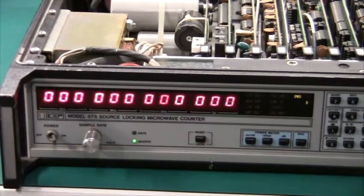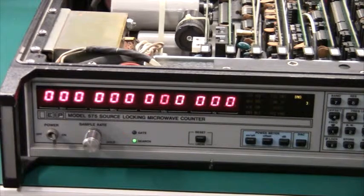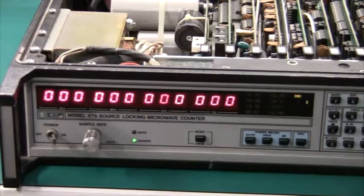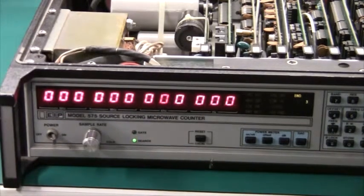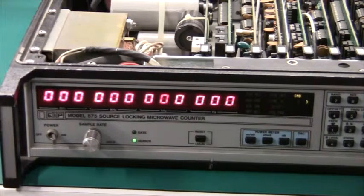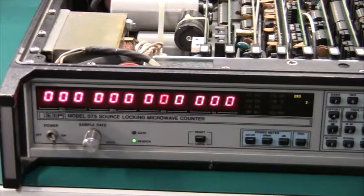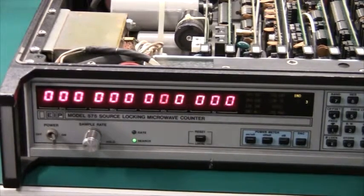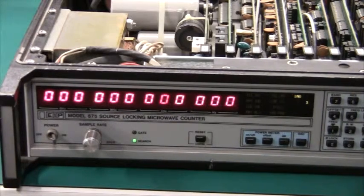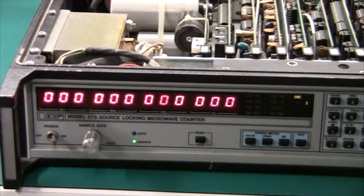The other thing that should not be working on this model is band 2 — I only need it for the 1 GHz to 18 GHz band, so band 2 not working is why I got it so cheap. I've checked the schematic; there's a service manual available online. Basically the power meter is just a DAC and a converter, so I should be able to implement that on a separate daughter card. The power meter card is completely identical to the 200 MHz counter card — the only difference is that little DAC — so hopefully they've used the same PCB and I can just plop in the DAC.